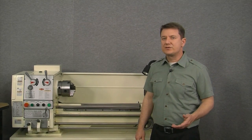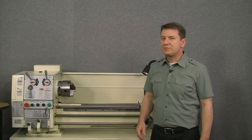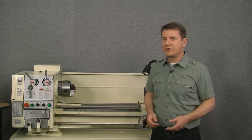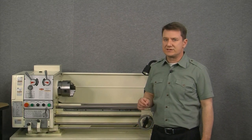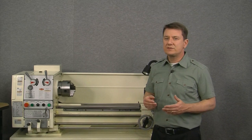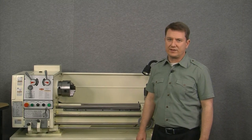So to summarize, we need a lathe kit that has travels of at least 6.5 by 29.5 inches. Now the smallest magnetic lathe kit DRO Pros currently offers is an 8x40-inch lathe kit, which is fine because if we have to, we can easily shorten or cut magnetic scales to exactly the length we need. Remember, with magnetic kits, all we really need to be concerned about is that the travels of the kit exceed the travels of our machine. Okay, so let's take a look at an 8x40 lathe kit.